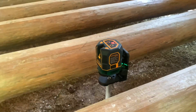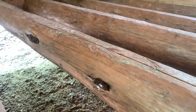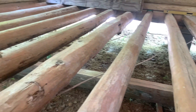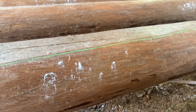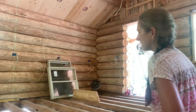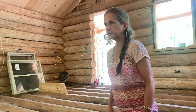You press the button on the top until the lights come on and they'll flash for a little while. What I'm doing is I've got it lowered down enough to where it's just clipping the top of a couple of the high spots on the log. You can see the green light right there. I'm going to plane that down. You can tell that one's a little high too — if you put a board on it, it rocks back and forth. There's another high spot right there by the door. Even in daylight you can see how well that light shows up.